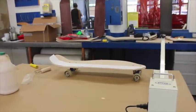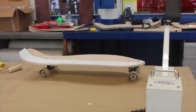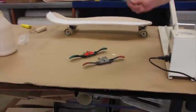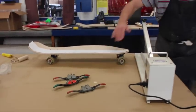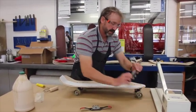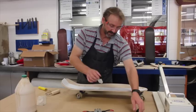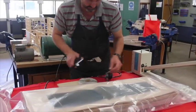Down to the style - students will look at you kind of funny, and I'm sure some of us haven't used these in a very long time, but the spokeshave is a great tool, fairly safe for kids. You can't get a plane onto the rounded surfaces, but you'll see the spokeshave will work those edges and get into those little curves really well. If you set the blade up, they can only take a very small amount, but they use that to round their edges off.